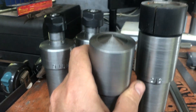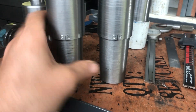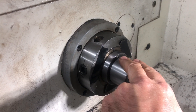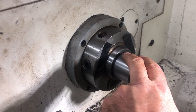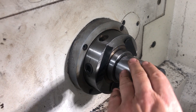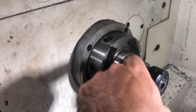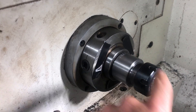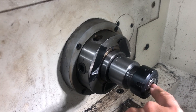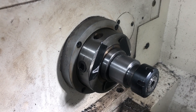The other important thing is to make sure you mark it, because where it was cut matters. My spindle has two to three tenths of runout, and I honestly think that's in the grind of the spindle itself — I've been considering regrinding this Morse Taper 5. With two to three tenths on spindle runout, I end up with about four tenths once I take this out and put it back in on that taper nose.